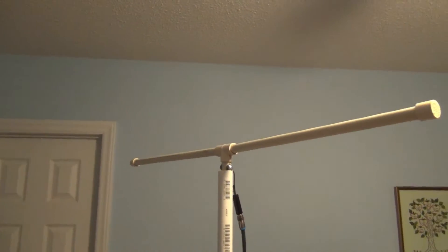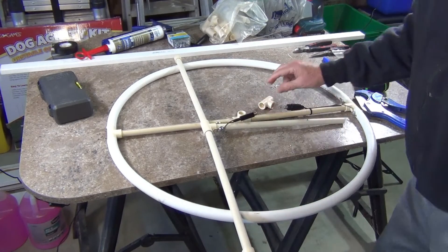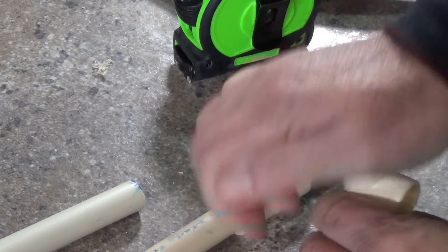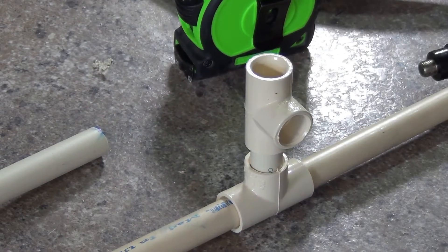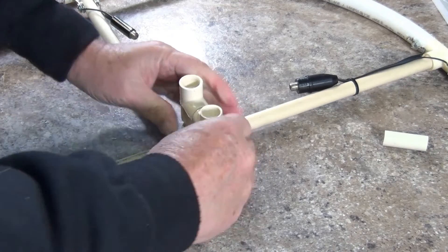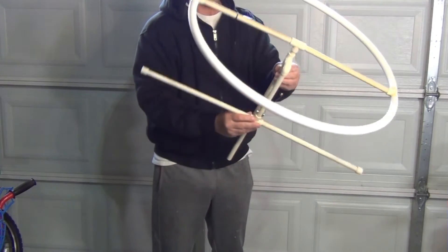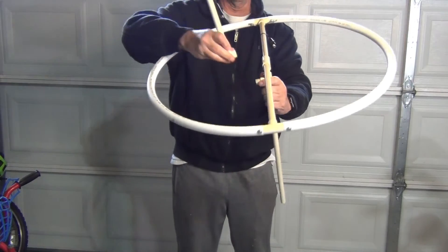If you want to add this to a UHF antenna, it's pretty simple — let's attach it to my hoop antenna. To help avoid any interference between the antennas, I cut the mounting pipe to 10 inches. I install an inch and one half piece of pipe into the hoop antenna's T-mount, then install a T-fitting. I'm not gluing these joints because I'm just doing this as a temporary installation. I use a one inch piece of pipe and an elbow, and the VHF antenna mast gets installed into the elbow. I prefer having the VHF element hanging down below, but if you prefer having it above, that will work too.